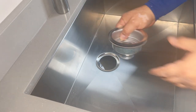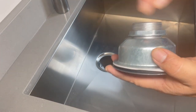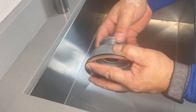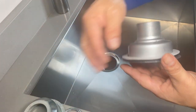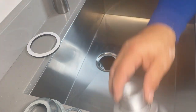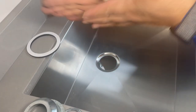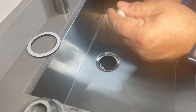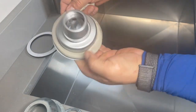In this video I'm going to show you how to install the strainer - the one that goes here - and the plumbing underneath. I chose this strainer because it's easier to install. We're going to remove this nut and the washer, put it on the side, remove this part, and remove the gasket and the paper gasket. Then we're going to roll some plumber's putty and install some around the basket.